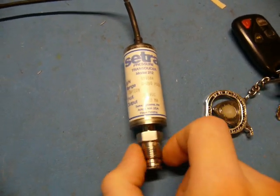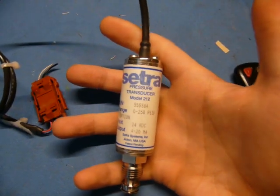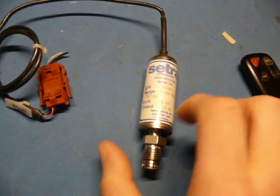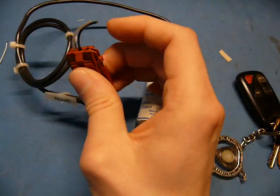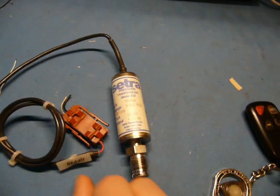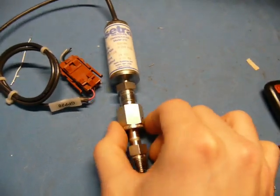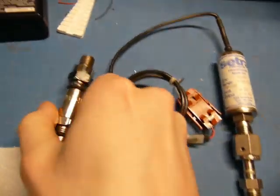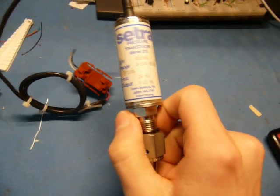Here's how I'm going to do it. I could just go to the dealership and get it read, but I figured I'd try it myself, because I like doing this kind of stuff. What this is, is a capacitive pressure transducer. Basically what it does is take your pressure reading and transform it into a 4 to 20 milliamp current at the output. This one covers 0 to 250 PSI, enough to handle the pressures in a non-running engine. Through a sequence of adapters I ordered from eBay — a Swagelok to NPT, then NPT to spark plug thread — I can connect this to my car. More on how to use these devices in a minute.